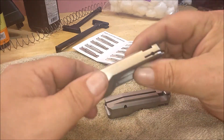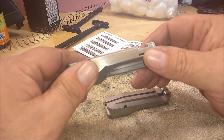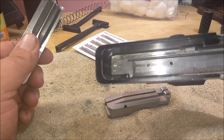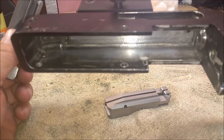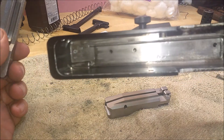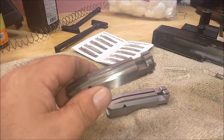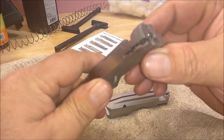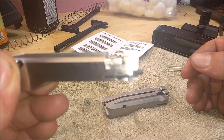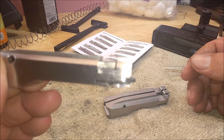The problem I was having with my stock Ruger bolt is this bolt is 20-plus years old. I looked this up and it was built about 1984. I bought this thing used 20 years ago. You can see I've done a little bit of polishing in there to try and slick it up, but you can see the wear inside the receiver. After they get wear on them, they get loose and you start getting the firing pin floating. You can see that firing pin has the ability to move up and down.